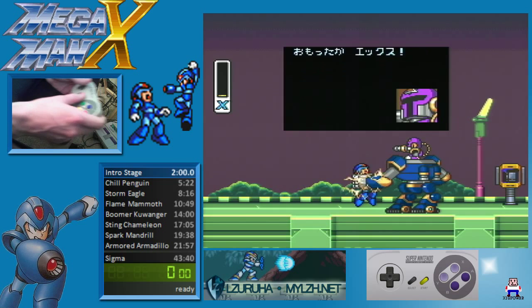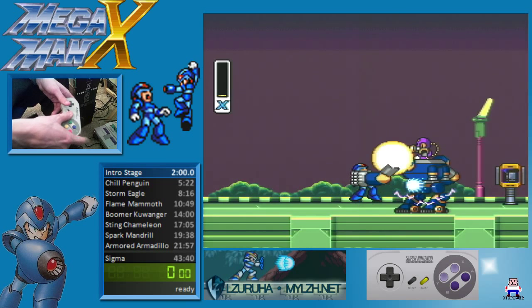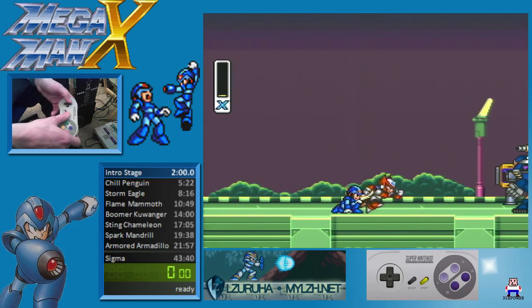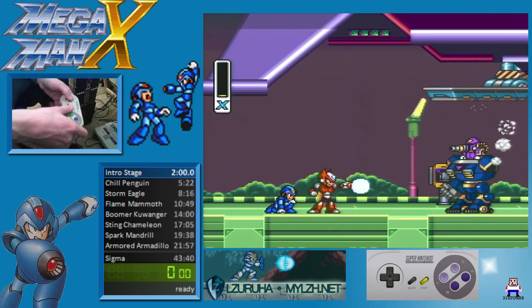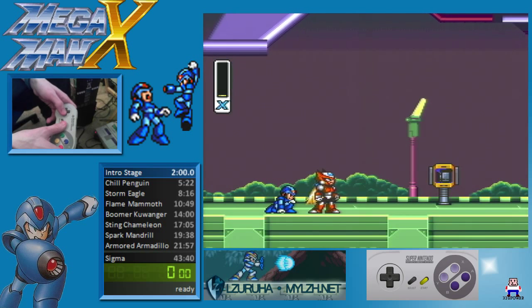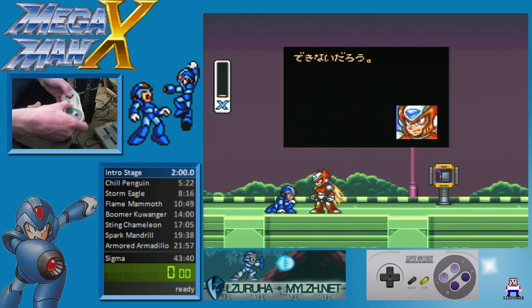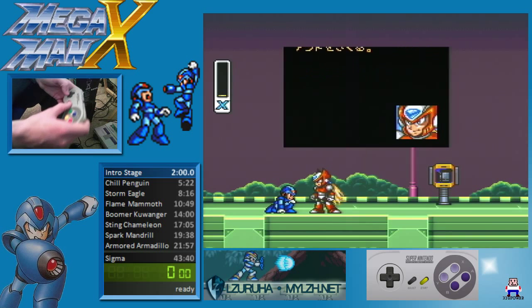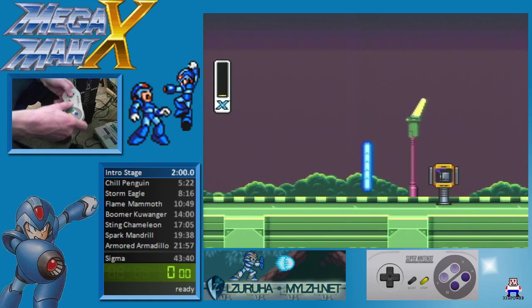It wasn't quick enough to actually pull the pin — it's like 4.5 microseconds for a digital read on the Arduino, and there's only a 12 microsecond window, 6 of that being high and 6 of that being low. So it actually became kind of a problem trying to rely on the input of the clock to time the controller. If we rely on the latch, we should be able to time the rest of it without the clock, so it's not a big deal.